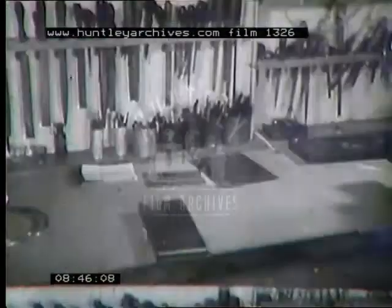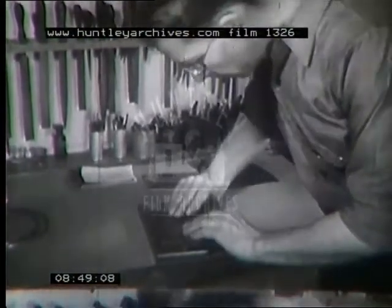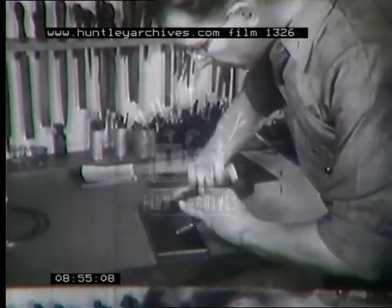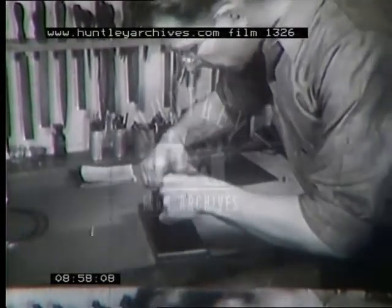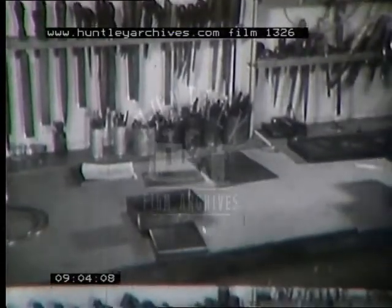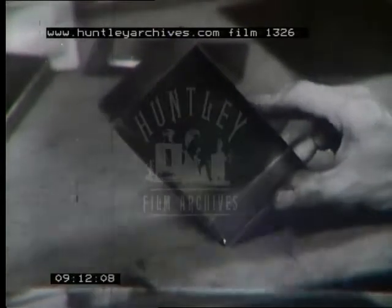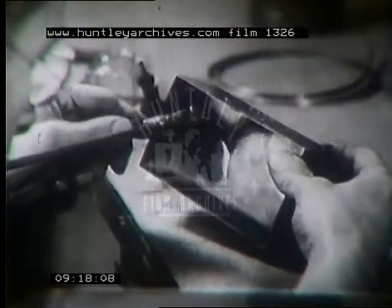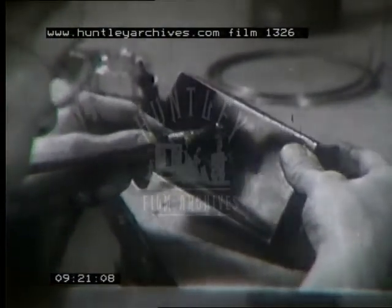When the chasing has been completed, the flat sheet of pewter is ready to be shaped. The inside of each edge of the bottom has been deeply scored to permit accurate bending. When this is completed, the sides have been brought up with their edges together and the box is ready for soldering. A small piece of solder wire and a tiny blowpipe are all the tools needed here. The deeply scored edges around the bottom likewise receive a smoothing and reinforcing application of solder.